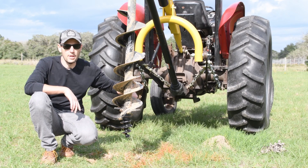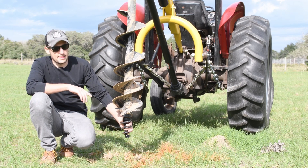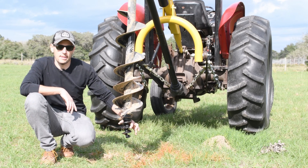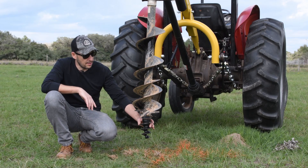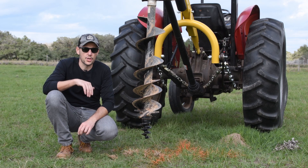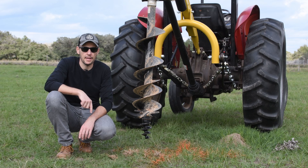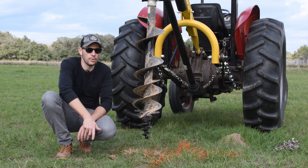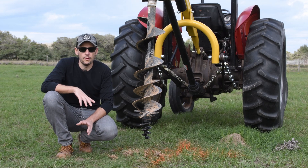I have three marks on the ground for each hole. The first one I'm going to do is using the stock tip, which is the one with the wider threads. In my experience this is not the best because the wider thread tends to screw itself into the clay. As soon as I hit the clay, which is two feet down, it will just screw the auger all in and it's going to be very difficult to pull it back up. Let's give it a try.